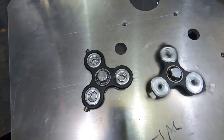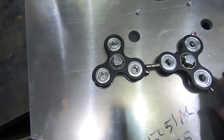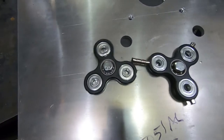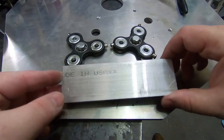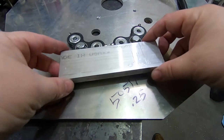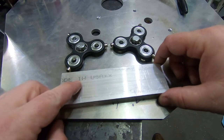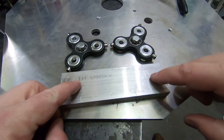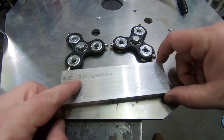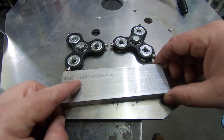I might make an adjustable jig so I can find a really perfect spacing between the two of them. But first, time to order some more magnets. A new day has dawned - I found this chunk of aluminum which will do fine. I want an adjustable slot here, so I'll drill and tap. One hole over here is normal, but over here I'll put a slot spanning about an inch, just enough that I can fine-tune the distance before I decide on the final spacing. Then I can swap out magnets and play with different effects. Over to the mill.